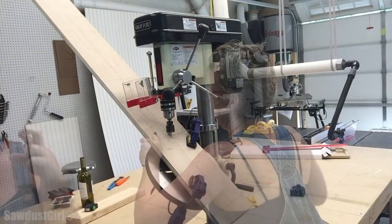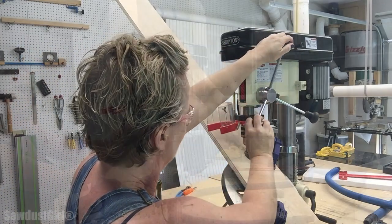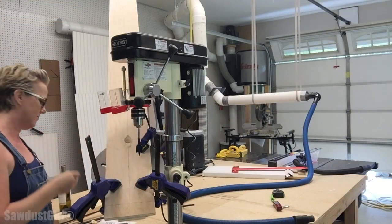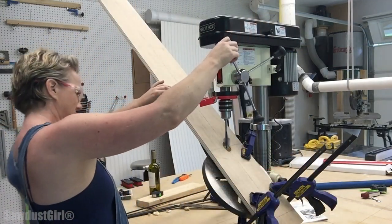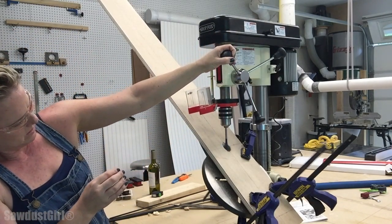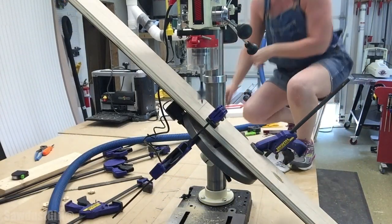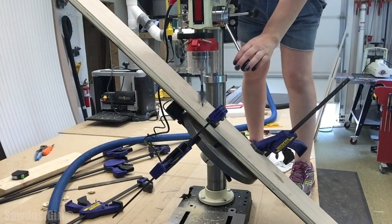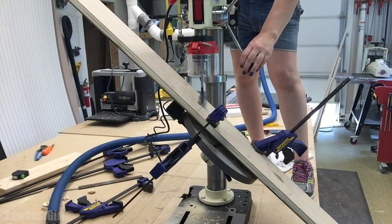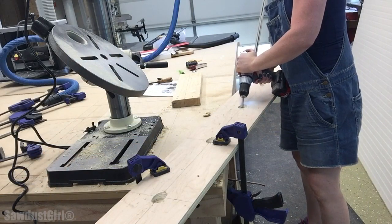Drilling a really long board at a really steep angle was very difficult. This was my trial run with this drill press. I started out with the drill bit I had on hand, which wouldn't drill deep enough, so I went and purchased a new spade bit. I realized I should have gotten a Forstner bit — this spade bit was freaking scary. I didn't like having my face level with the bit, so I climbed up onto my table to finish drilling. There was a lot of play in the spindle arm on the drill press — a lot of wiggle — so I just didn't feel comfortable with it and finished drilling the holes by hand.